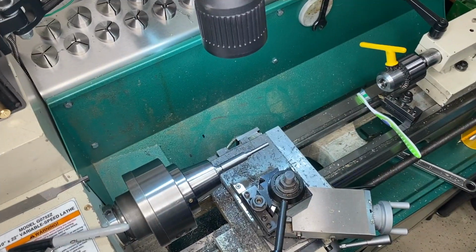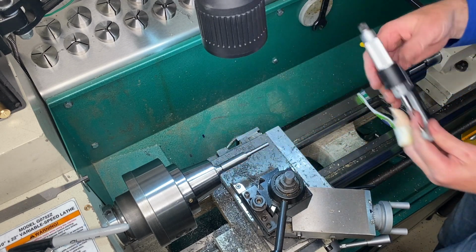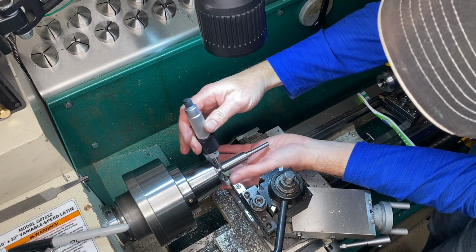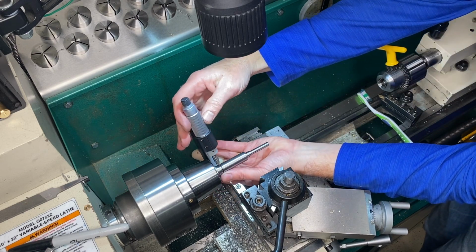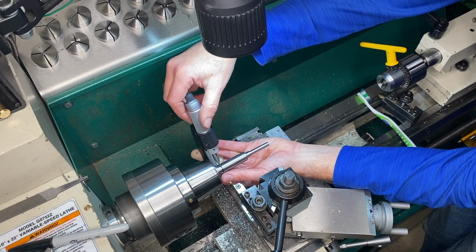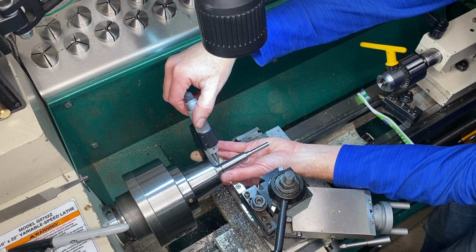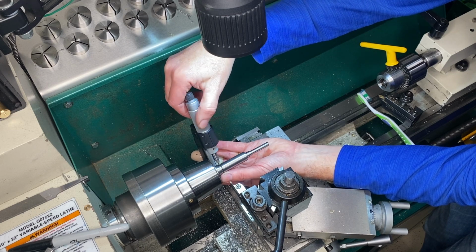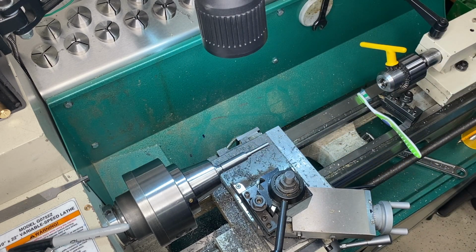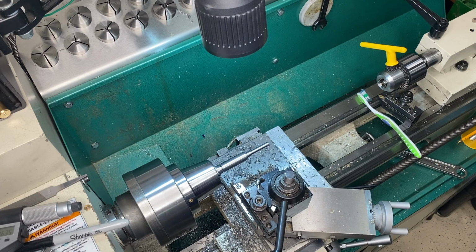So I'm trying to get this slot in place. It's not really a slot, but it's the other bearing side. What we're doing here is we've got a blade caliper, so I can get in there. I'm using a cutoff tool, and we'll see what we got. We're about 1.5 thou big on the OD, so I need to come in basically like 1/2 thou. So it's pretty much there. We'll leave it at that.